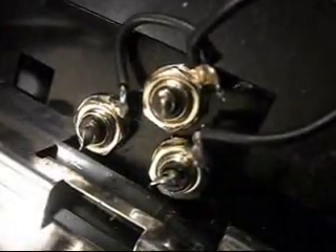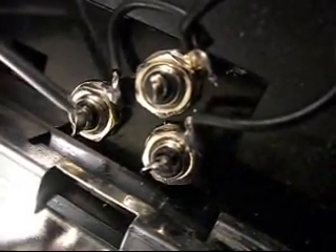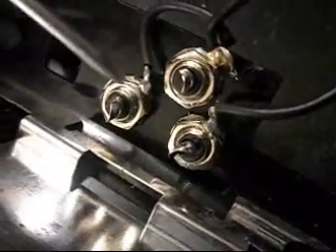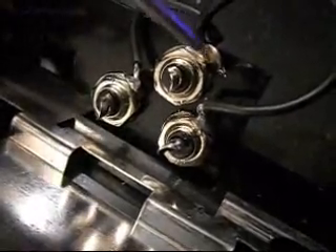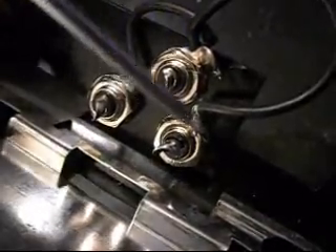I'm going to go ahead and add the bottom case and connect the phono plugs. Here are the phono plugs I installed. I used a quarter-inch drill bit in order to drill the holes — you can drill the holes however you want, I decided to do it this way. I'm going to use this one for my video and these two for my audio here right next to each other. As you can see, they're all sharing a ground, so you can connect the ground wire to any of these three points here.